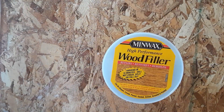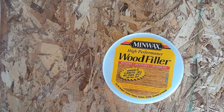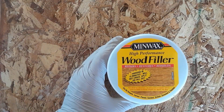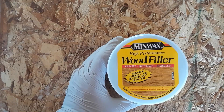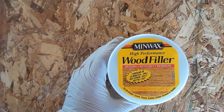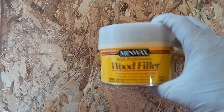Hey YouTube. Today I'll be going over Minwax's High Performance Wood Filler with you. If you haven't used this product before, it's primarily used to fill and fix rotten wood. What makes this brand of filler and other epoxy-based fillers like it especially nice, in my opinion, is that it's weather and rot resistant — so you can use it on interior projects but exterior projects as well.